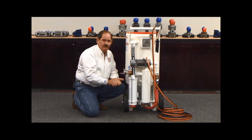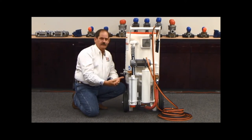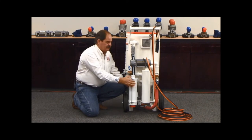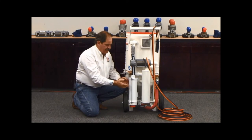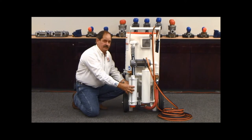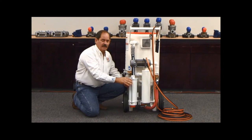Store-bought mufflers are not designed for this application. They have filtering elements in them, they can clog with abrasive, they can clog with moisture, they can retain vessel pressure, they can put a person in a dangerous situation. We designed this VBS specifically for this application. The way that we introduce the air into the VBS to a urethane target plate, with the specialized materials in this vessel and the exhaust configuration on our VBS, have answered all of those issues specifically for this application.